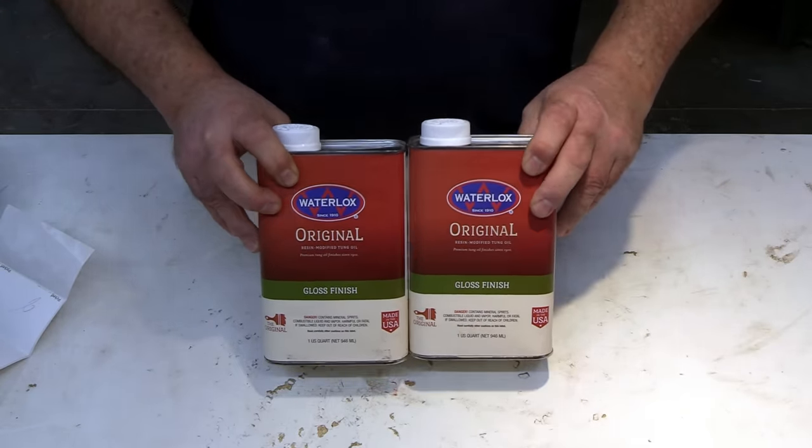You may not understand, but you can actually sand away a lot of thickness on a piece just in the sanding process. So that's another consideration when you're turning pieces like this. Always leave enough material there to sand it, to get rid of all your little lumps and bumps and tear out and this kind of business.